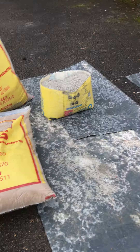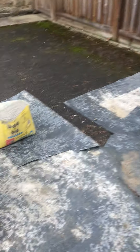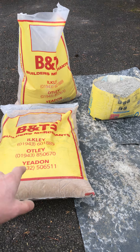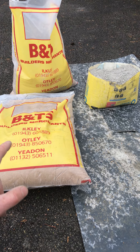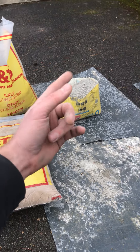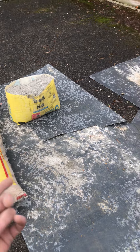Normally I work five to one, so if I did five buckets of sand to one bucket of cement that would all go in, but that would be too much. So I've got these bags from the builders merchants — these bags are 35kg and normally the other ones come in 25kg, so for ease you just go five bags at 25, one bag of cement at 25, gives you a five to one mix. That's an easy way to do it.